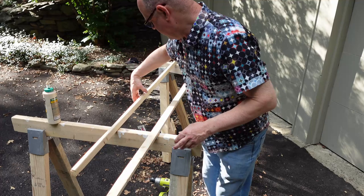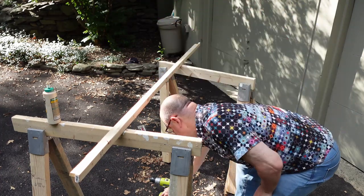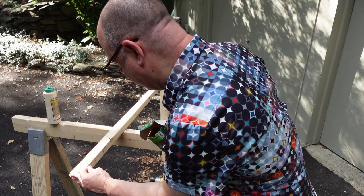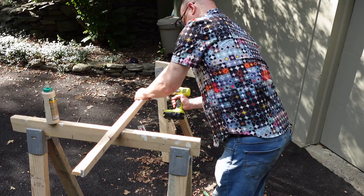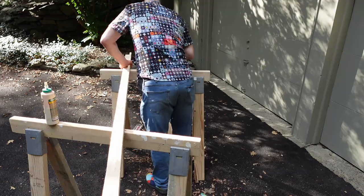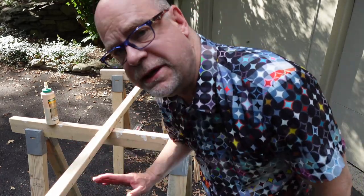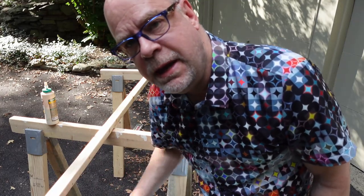So once we have our glue down, let's lay this on its flat side and take our other piece and butt it up against it — we're creating that L. There are a number of different options here; you could put in some nails if you have some. I'm going to take advantage of some two-inch screws left over from a previous project. This will be perfect for being able to push into the bottom of the piece of wood that's sitting upright and into the base of the one we're gluing against. So now we have this all glued up and the screws are in. You don't have to go too extreme on the screws — I've spaced them about two feet apart. We really want to hold them together mostly so the glue can do the work. Now we're going to let the glue dry, and once we're done with that I'll show you how we can cut this up to make the frame that we need.